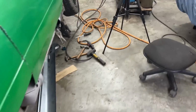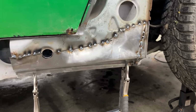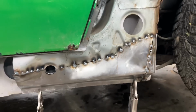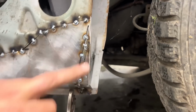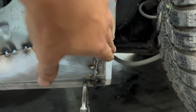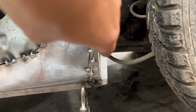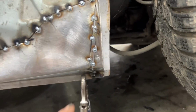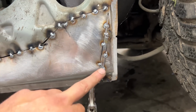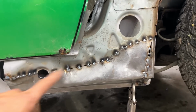In the meantime, you saw what I've done. This masterpiece here. Yeah, it was a lot of improvisation, as you saw. Most of it I bent directly here on the car. And at some point I realized that this flange was going too far out. It was supposed to meet here, because this is where our other piece is gonna match the cover here, which has a flange on this side, but it has a flat piece coming out this way that needs to match this. So that's why I made this cut here, and I bent this out a little bit, and I put an insert piece here because the gap was too big. This is something that Nicole can finish.